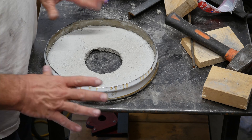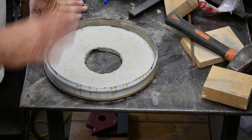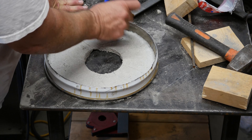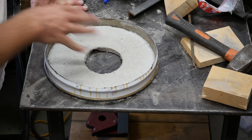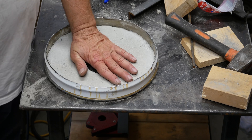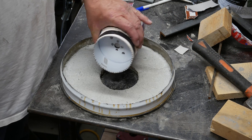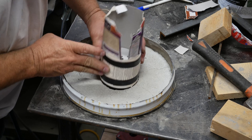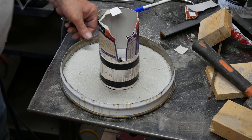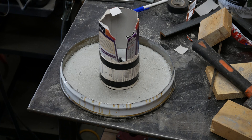Anyway, I'm going to break this out of here with my hammer. The good news is it stayed intact — it broke along the line I scored, so that was good. But it broke here, here, here, here, all the way across. I'm going to fill this thing full of that stuff I showed you at the beginning — the dry mix, the mortar — and I'm hoping that will be enough to hold this in place. What I'm going to do this time is line this hole with something — some cardboard — to form a nice cone, so I have a clean opening in my hole. All right, I found a use for this — reuse, don't recycle. There's my form.